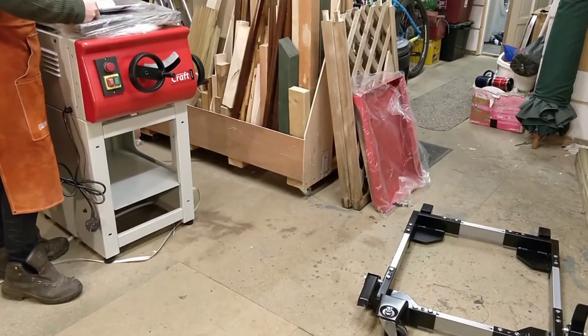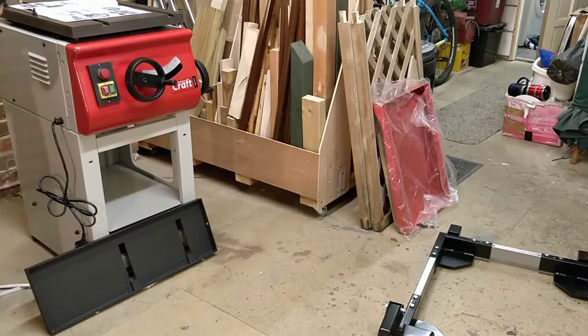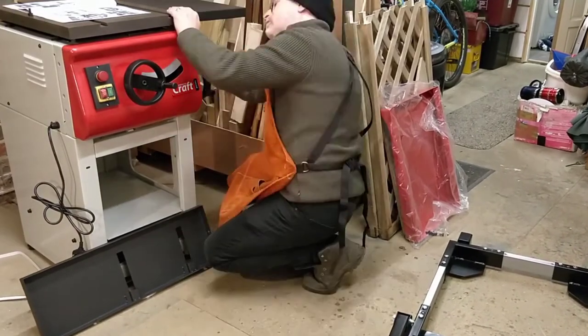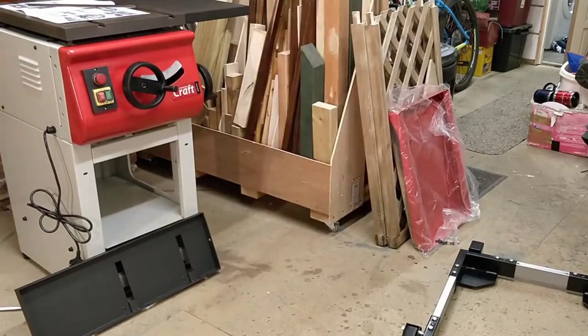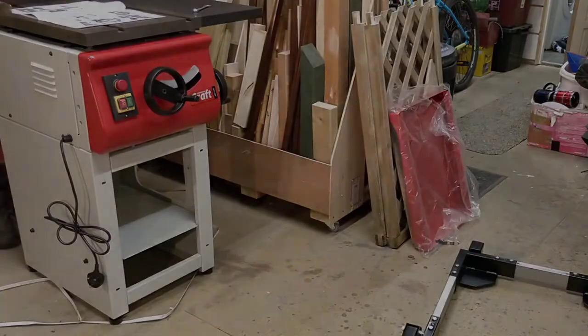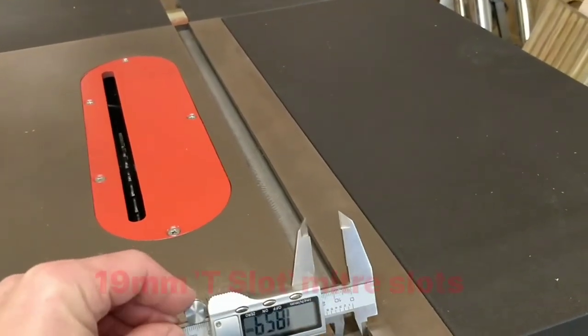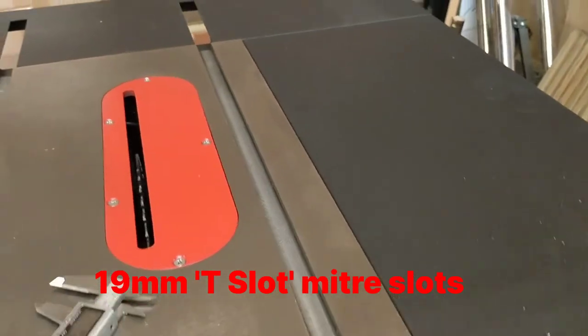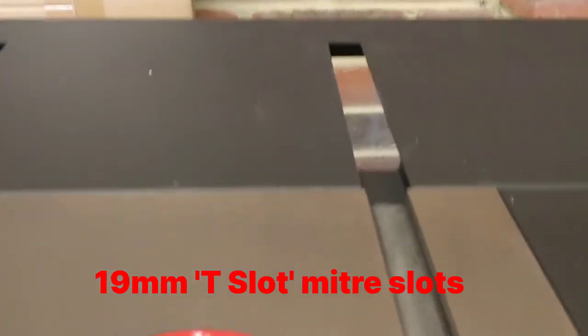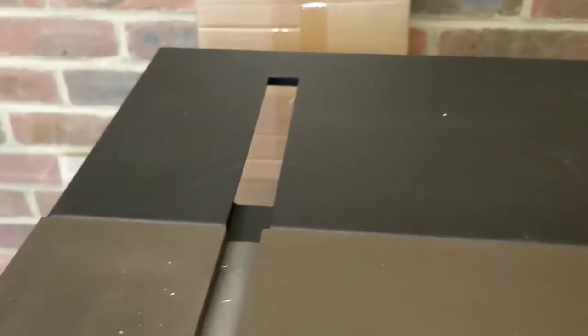I'm fitting the right-hand side table extension — this is made of sheet steel and screws into threaded holes in the side of the cast iron table. I then fit the rear table extension made of the same steel; this has gaps that line up with the mitre slots so that any jigs using the mitre slots are free to pass. Both the side and rear extensions sag a small amount but I don't think this will be an issue. The slots are a standard 19 millimetre, and the extension table has holes so you can push sleds or other jigs past the cast iron table into the extension without them fouling.